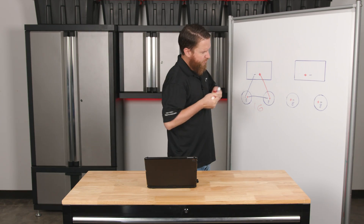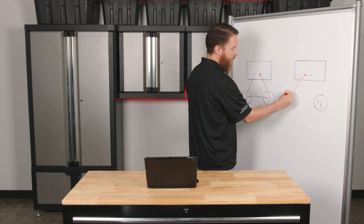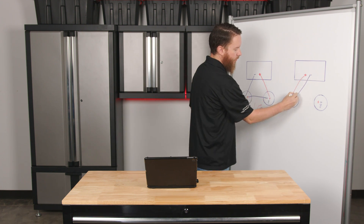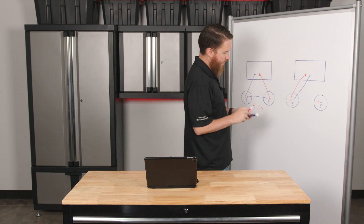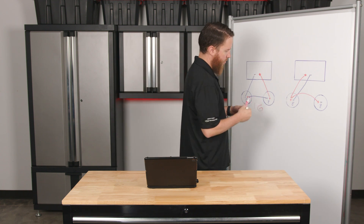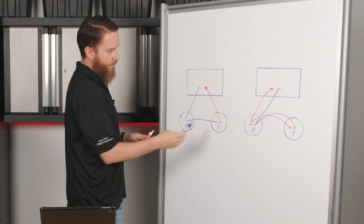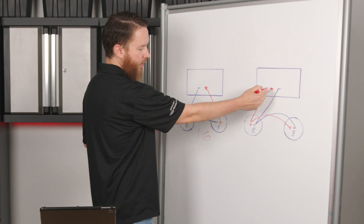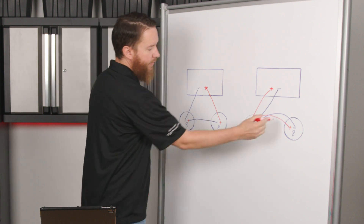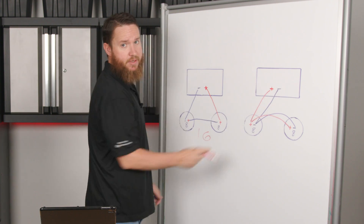In contrast, we're going to wire up this amplifier over here in parallel. So I'm going to take my positive wire and wire that to my first speaker, and then take a negative wire from the negative terminal and wire that here. From there, I'm actually going to wire from the positive terminal of speaker one to the positive terminal of speaker two, and repeat that for the negative. So I've essentially taken positive to positive, negative to negative, then jumped positive to positive, negative to negative. If I wanted to, I could technically wire this not from the speaker, but run a second home run from the amplifier. Wiring from the amplifier directly to a speaker is called a home run.